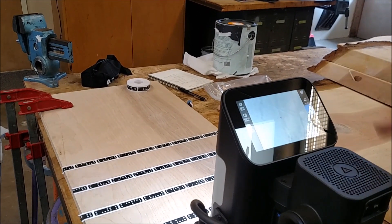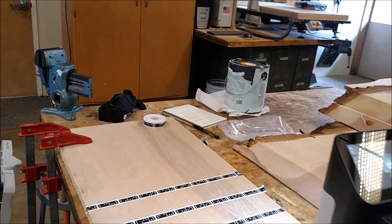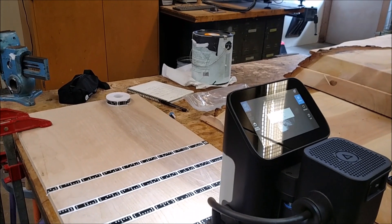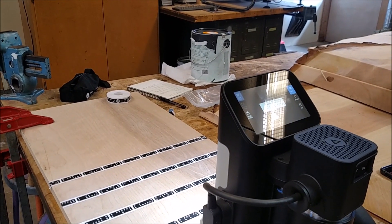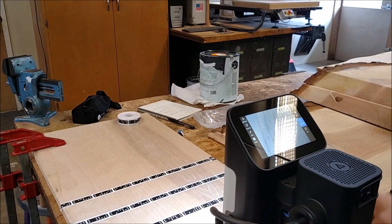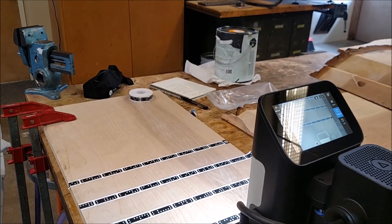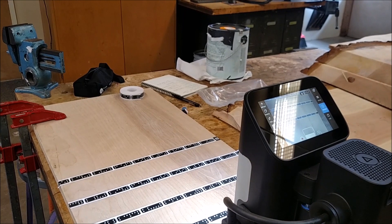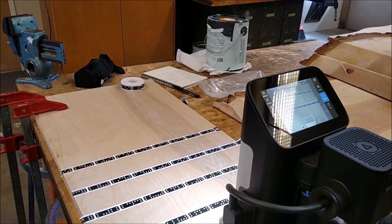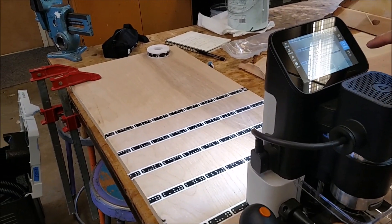I'm going to actually scan it again since we've got it clamped — it's going to be a little easier. A cool thing with how the files are stored is you could share one of these tools and have several projects going on this table. I'll scan my work piece and then if I bring the machine over and it sees this tape, my work piece and any patterns I put on it will show up. If we take it over to yours and you've scanned your tape, it'll switch and use that work piece — so you can share a tool while someone else is fixturing and getting ready. That's a gigantic feature. This thing's going to be really cool for students to use.